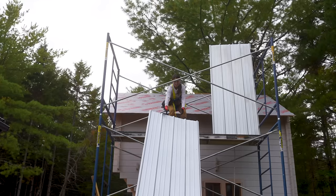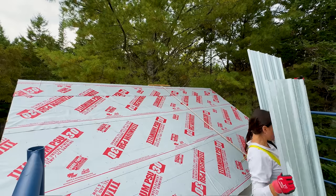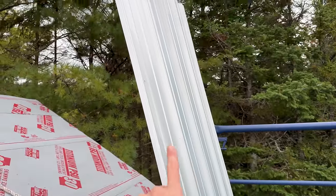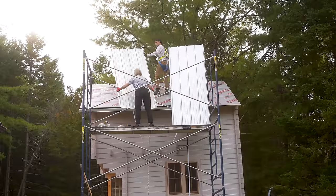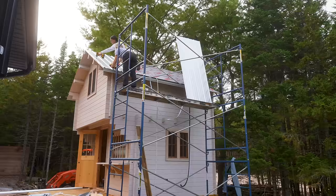The roof is just about 14 feet. So we have pre-drilled five sheets — the fifth one's going to have to be ripped. Figuring out how we're going to get them up there, we also did some mathematics. Our pre-drill holes will go exactly where our rafters are. The roofing boards are pretty thin on this bunky, so we want to make sure the roofing is completely secured into the rafters and that way you don't see any screws inside as well. Drip edge. And we're ready for metal.